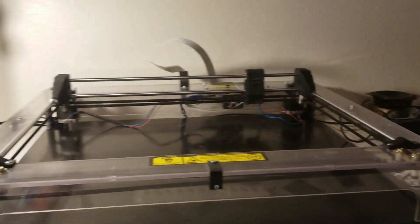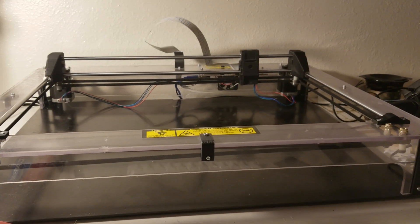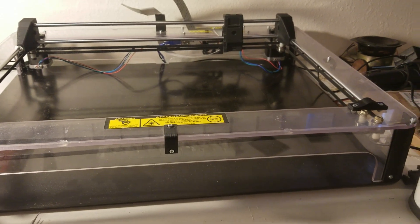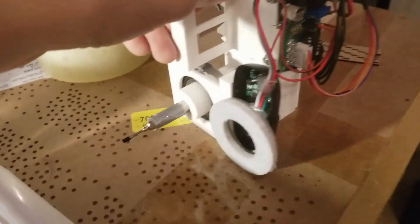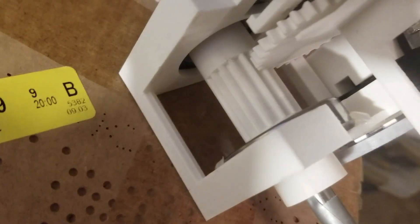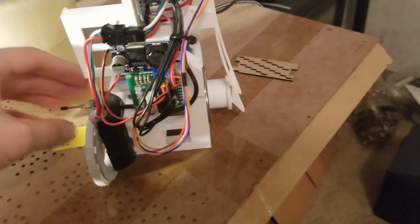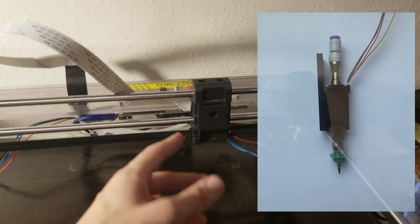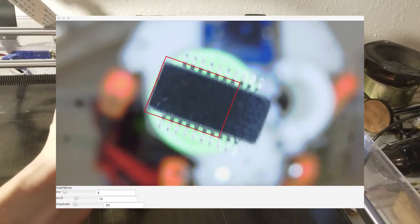So I will commission my old laser cutter — crappy's a mean word, it just wasn't what I wanted — to be a more proper pick-and-place machine. Basically, I'm not going to use a handheld vacuum tool with duct tape friction-fit into a 3D printed toothed cylinder rotated by a stepper motor. I will instead use a NEMA 8 hollow shaft stepper motor on a linear rail with a Juki nozzle adapter — a real pick-and-place machine nozzle — moved around on a Core XY gantry.